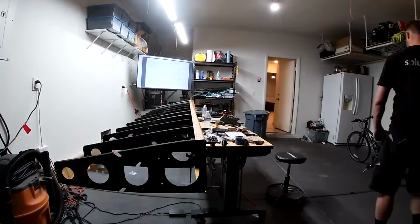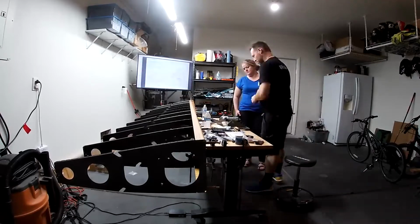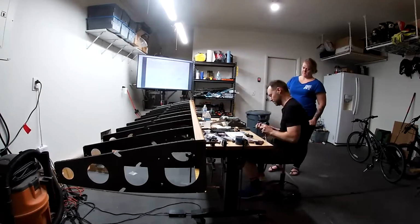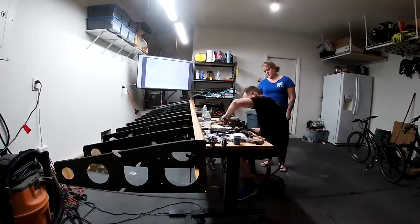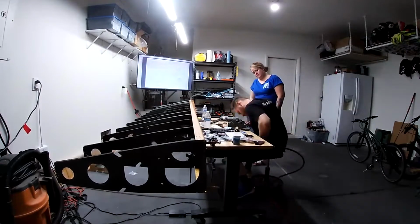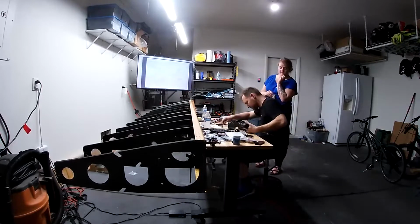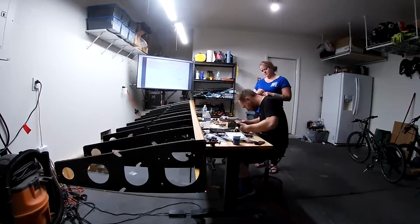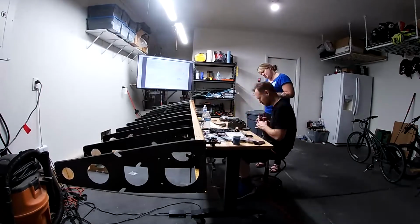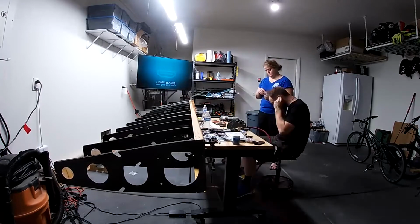Okay, so this is where reading the directions is prudent, because on the end wing rib for the, what is this thing called, torque tube support subassembly, this is section 14-2. It says put the subassembly together, then rivet it to the wing, and I didn't do that. I riveted it to the rib, and then tried to put the subassembly together, and then realized that's not going to work. So I had to use the rivet gun instead of the squeezer to get the rivets into this subassembly.